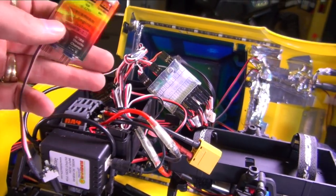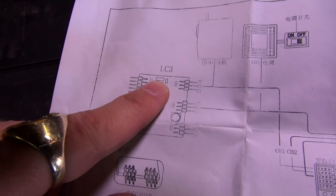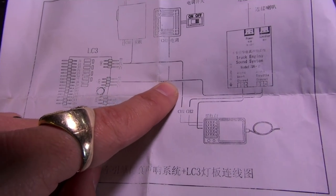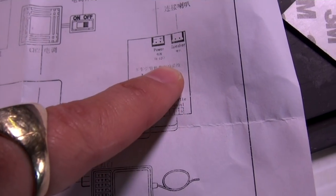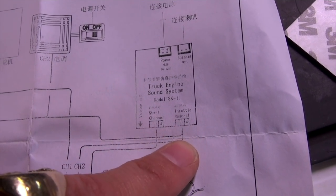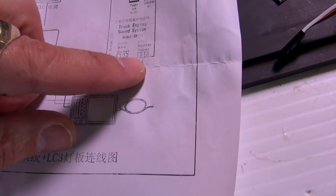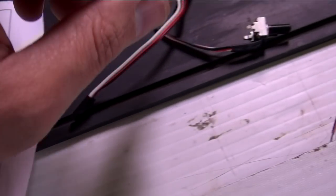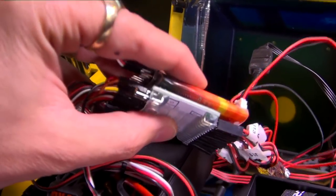Just try to keep it tidy. Don't let it intimidate you — easy to do. So this is the lighting board. They're telling me to go from channel two straight in to the throttle channel on the sound unit. And then out — because there are two leads here, top and bottom — out it's coming over to the receiver. That is exactly what I'm going to do. But first, what I want to do is take some double-sided tape and mount these together.